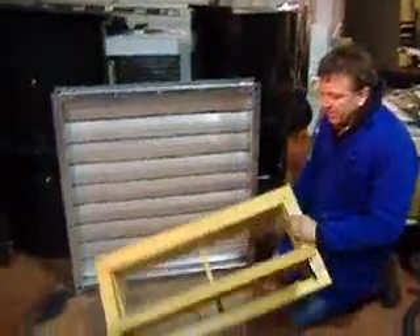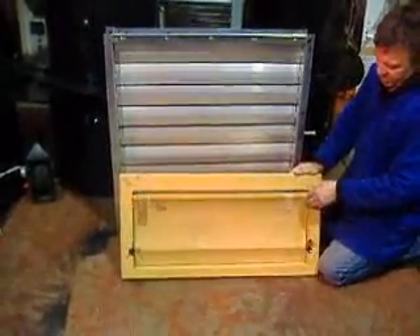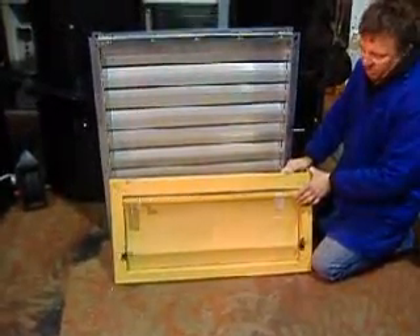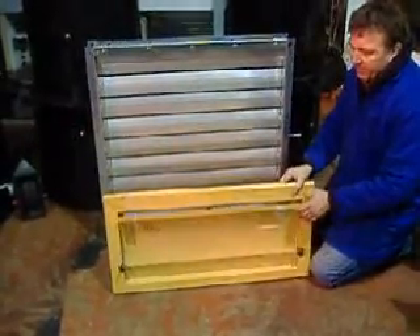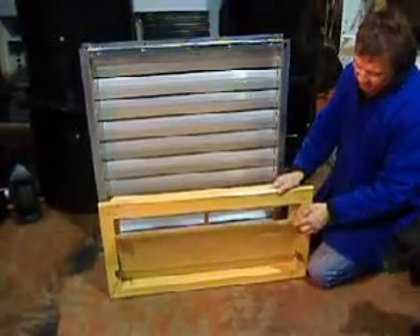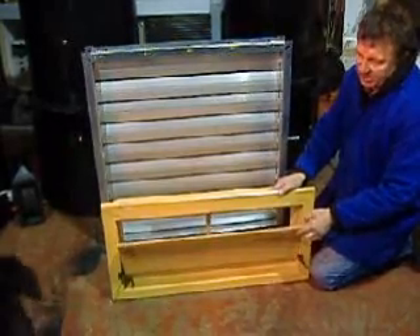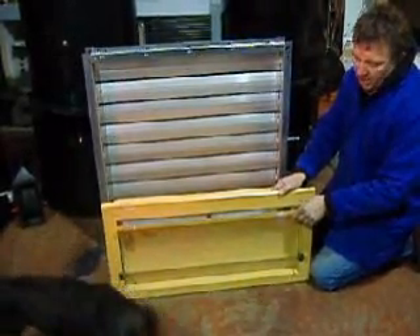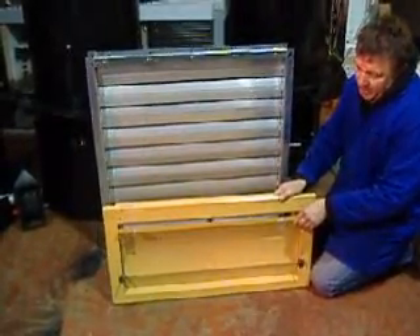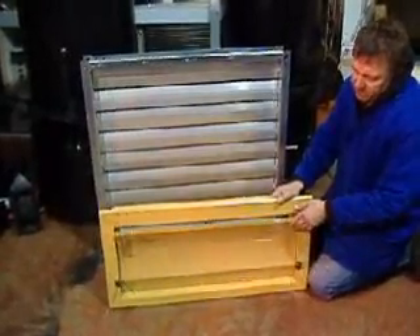The alternative is the foam inlet. This is a big version of it — they're normally a lot smaller, designed for siding along the sides of the sheds, metering air in fairly precisely through the gap between the blade and the housing. We're gradually throwing air up here onto the ceiling, up along the roof space — generally used for cool air, keeping it away from the crop and away from the litter, letting it warm up a little bit, and generally used for minimum ventilation.